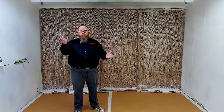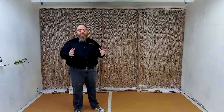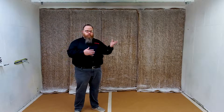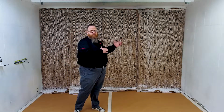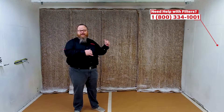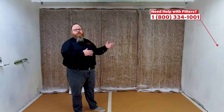There are really two major camps when it comes to standard paint booth filters. The dominant camps are polyester filters and paper filters. What I'm going to show you today is an installation using Colbeth's RP Arrestors — specifically the 5200 W Series, which is a very new filter to the market.